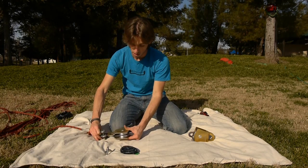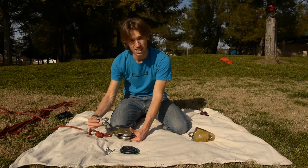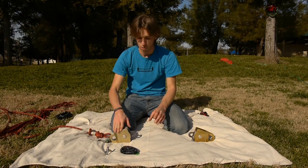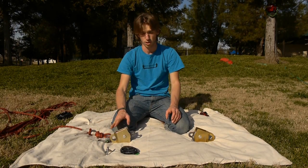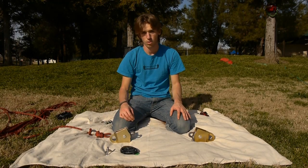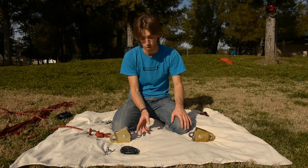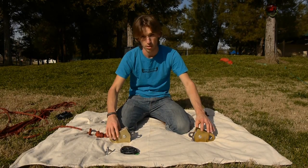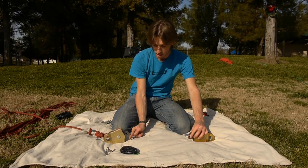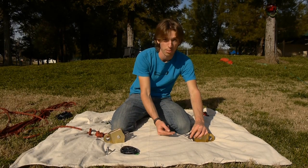Sometimes when you have a horizontal pulley and your connector is vertical, it's harder to build an anchor to that. A con of the right-to-left reaving method is you'll get a lot of friction within the strands of rope running through the sheaves of the pulleys, especially from the knot going to the first sheave — the next strand coming out the next sheave will often rub up against it.